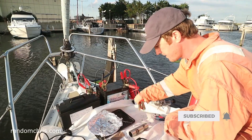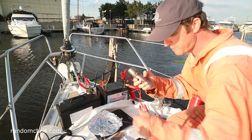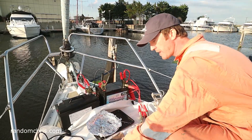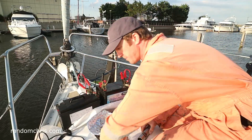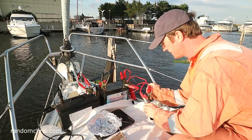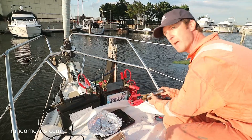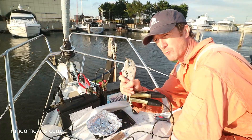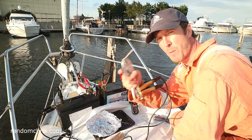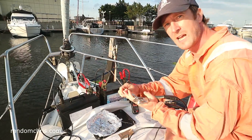I've got the positive connected there, going to the workpiece — these were two sections of tube until yesterday, I've just been messing around a bit. I've got them connected and I'm going to continue to weld these. We're going to have the electrode on the negative, so we need to connect that to the battery and this to the workpiece. I'm using stainless steel rods here because I'm on a boat and any welding I'm going to be doing is stainless steel — they're quite thin, 1.6mm rods. I'm just using a set of mole grips as my electrode holder.